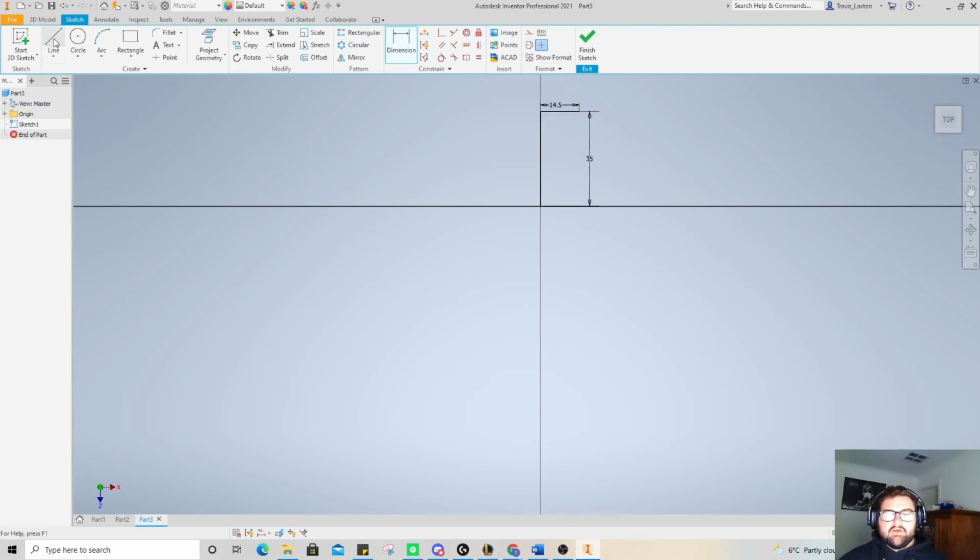Cool. Alright, so then we need to do the rest of it going down. So that's going to be going down to approximately halfway, which is 17.5. And then what is half of 14? Because we're going to have to be threading this end. So actually it's easier if I right click and go OK, line, and we'll start from this end. And half of 14 is going to be 7. Press enter. This should snap, so you can see how there's that little line going across here, and then I can just join those together like that.